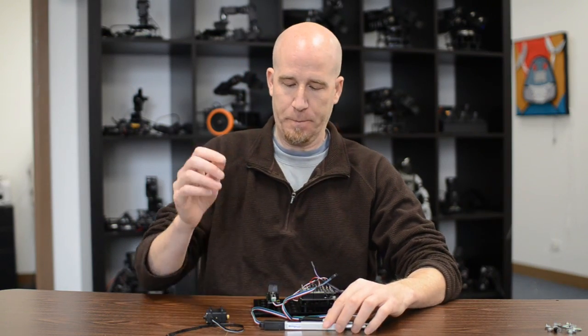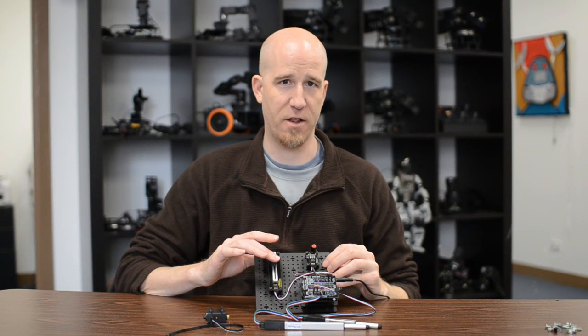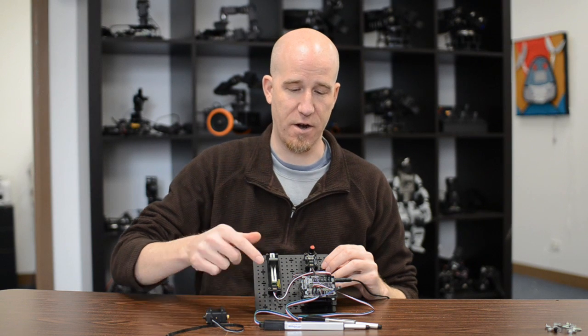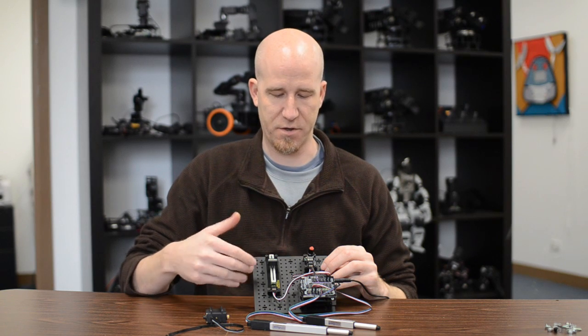So let's show you how we do this — it's not too complex. What's really happening is there's a zero to 1023 signal that comes in off of analog sensors, and that's being mapped out to the PWM output on the linear actuator. We have one of these mapped to each linear actuator, and the actuator moves to the position that the sensor is at.